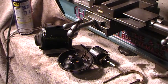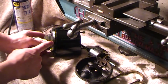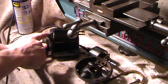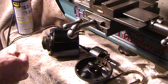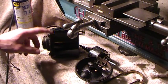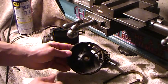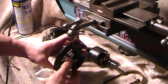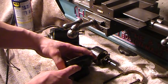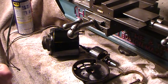Just another quick random tip — when taking apart an electric motor, the side of the bell housing that has the switch on it is the opposite of the output shaft. I would shy away from taking this one off unless you're doing a complete restoration or in-depth cleaning. If you do, be careful because there are wires attached to the windings and they're always old and brittle. Also, if you ever want to soak bell housings in anything to clean them up, remember that there's going to be cotton stuffed in the oil hole to wick up the oil — that wick is going to hold whatever you soak it in until you let it evaporate.